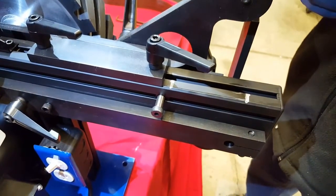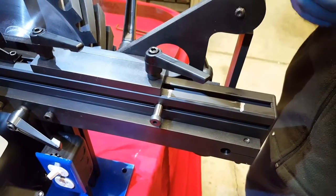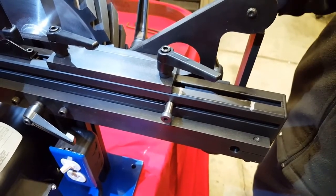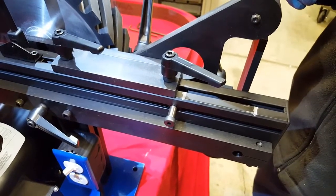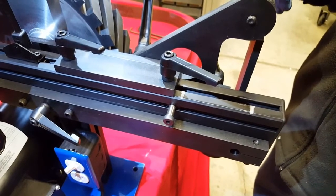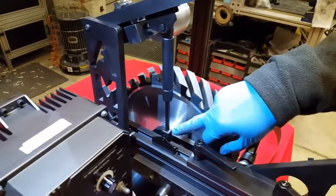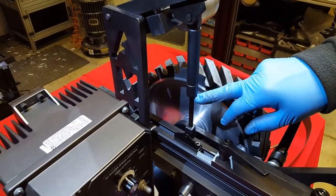Your machine gets about a 3 to 6 hour run on a bench where they run continuously through all speeds, changing over from wheel to platen. So this is where the particular belt we shipped with it was set at. You can set it anywhere you want if you have a different type of compression tendency or compression that you want on your shock. We generally tell people that the distance between the bottom of the shock and the top part of the shock is 2 3/4 of an inch.